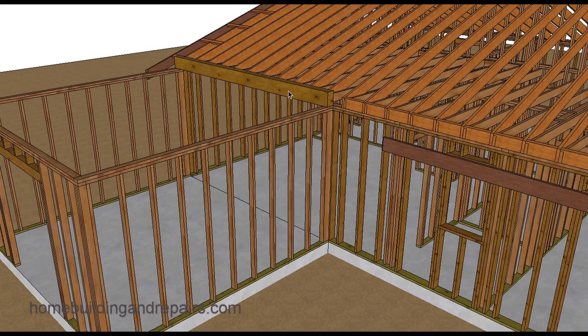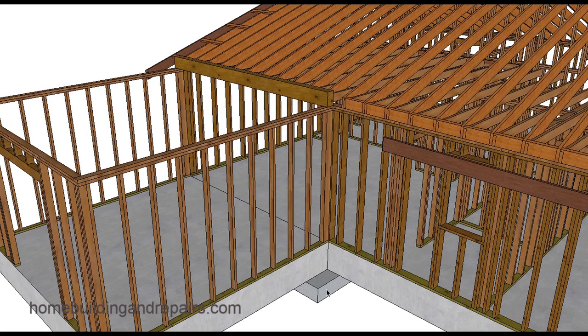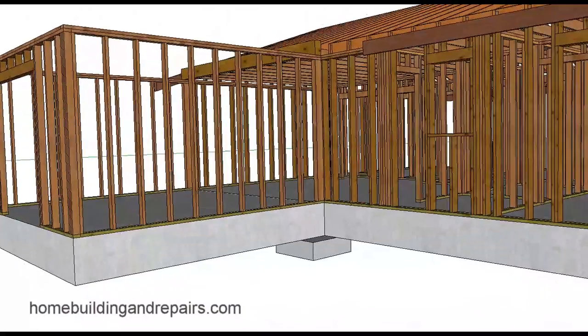Don't forget that the beam is actually transferring the weight down. All of the weight from the roof rafters and anything stacked on top is transferring down to the post and down to a concrete footing. Here's the problem most people miss: you might actually need a larger pad — some type of concrete pad to support this weight. The regular house footings might not be enough.